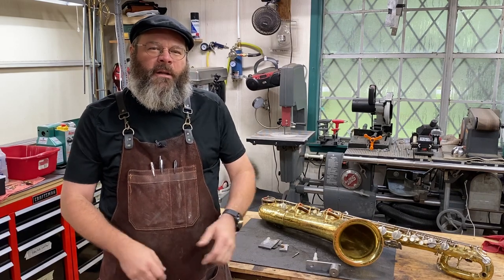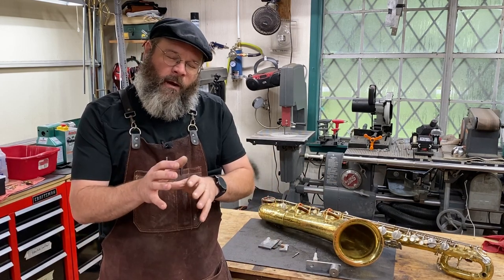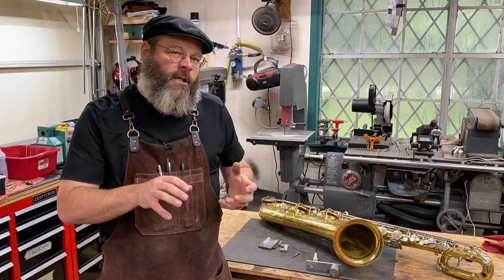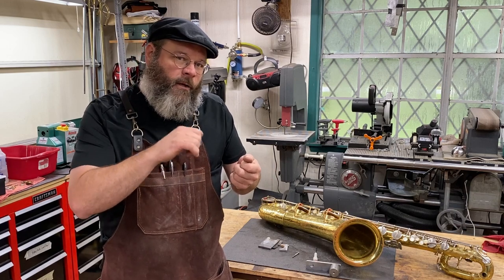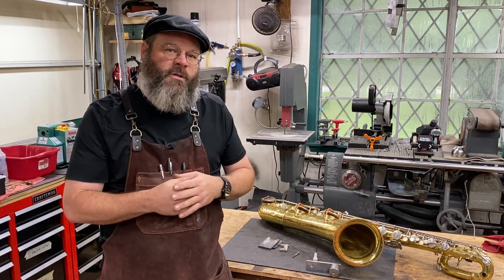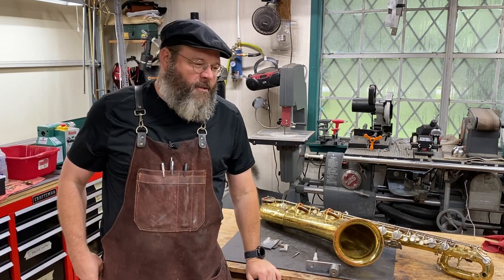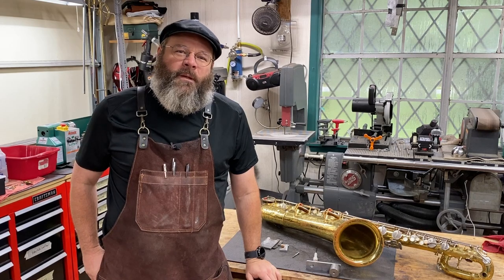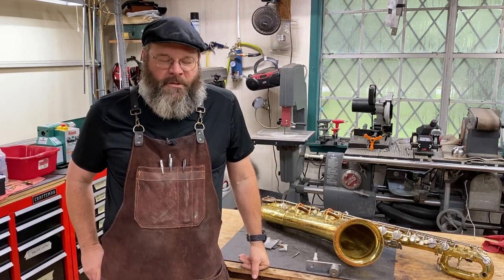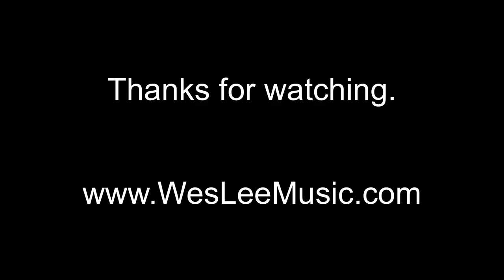So that's the mystery of how to straighten the body of a saxophone. Thanks for dropping by. A lot of people think that's a pretty scary thing. Notice how I was keeping my hands exactly where the bend in the body was — I'm feeling for total control. Just like when you're hammer tapping or anything else, you start light and increase your pressure. Get a feel for what the metal is going to do before you commit 100%. Feel it out — you'll be golden. Thanks everybody for the comments and subscribing. It's a really cool community. For all you techs out there, I'll put the part numbers down in the description with a link to Ferree's Tools. Call them up, get yourself some of these cool tools. Thanks for dropping by the House of Tone today. My name is Wes Lee, signing out.